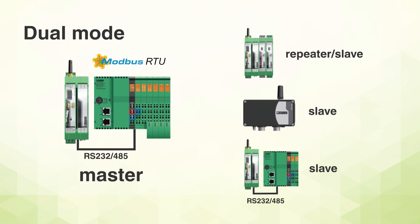Four: in the PLC Modbus RTU dual mode, the Modbus RTU protocol can also be transmitted in addition to I/O signals from remote stations in parallel. This allows further Modbus RTU devices, such as measuring devices, inverters, or control systems, to be connected at remote RadioLine stations.